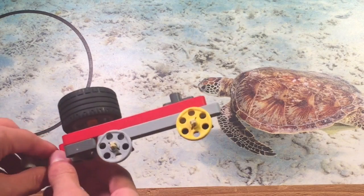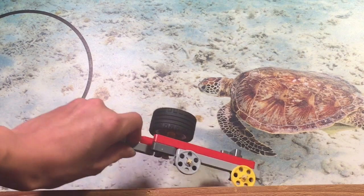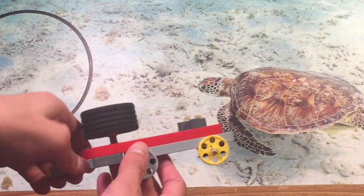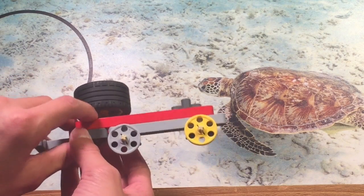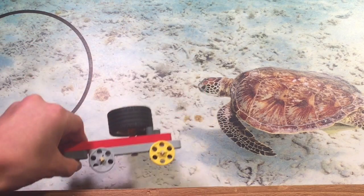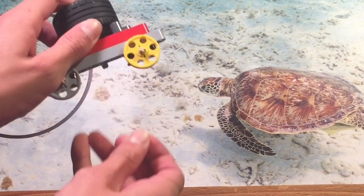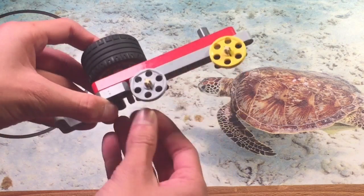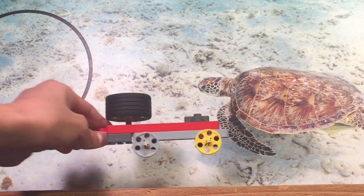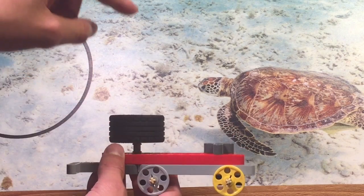Now we'll talk about the placement of the three wheels. The leading wheel is the only wheel coming into contact with the wall when you're following it, whereas the following wheel only contacts the wall when you're exiting. To find a good balance and power ratio, you have to test around a bit. If you put the driving wheel too close to the leading wheel, the robot would swerve in and crash into the wall. The distance between the driving wheel and the leading wheel determines how well you'll follow the wall, and if you adjust this distance, you also have to adjust the power ratio between the inside and outside driving wheels.